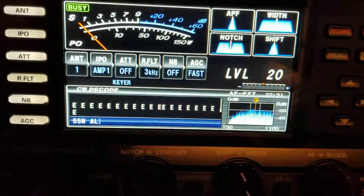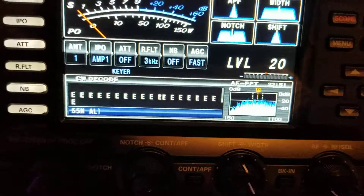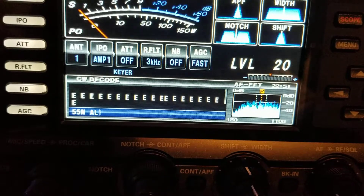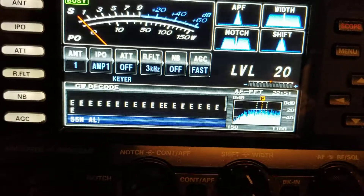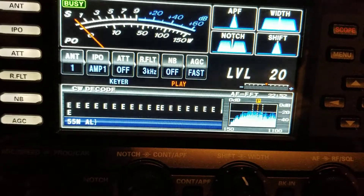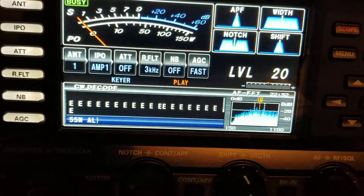On the 1200, when I sent stuff by memory that was put in by keyer, it showed up in the decode window. Here with the 3000 — nope, that isn't working. That was memory 2 — excuse me, that is memory 2, and it is working because that's a text message. Now here's memory 1, entered via a keyer — it does not work.